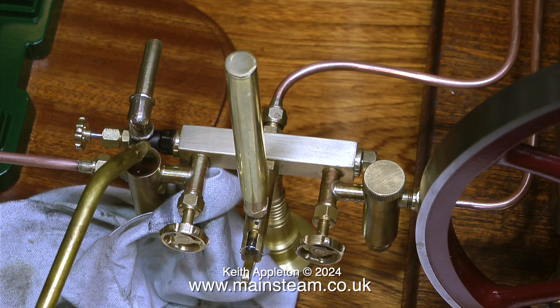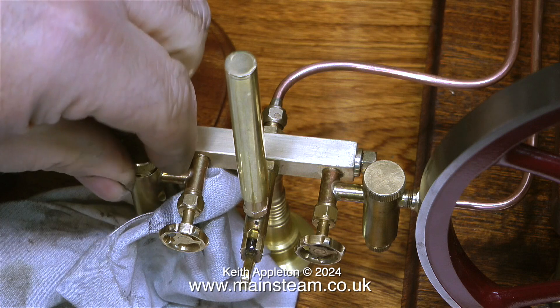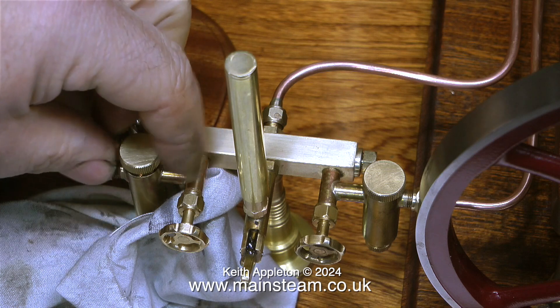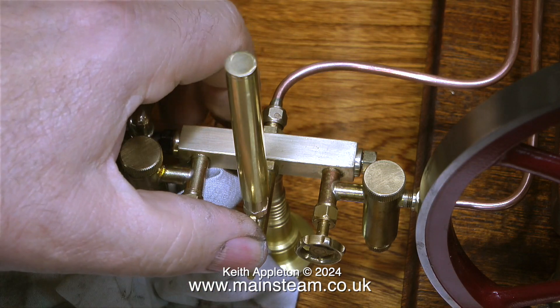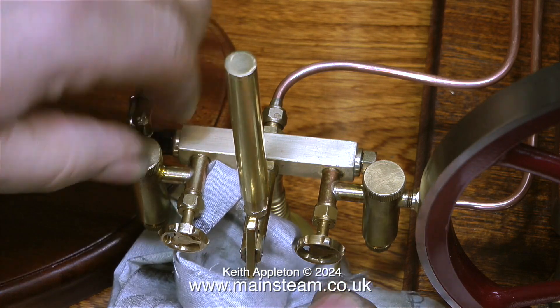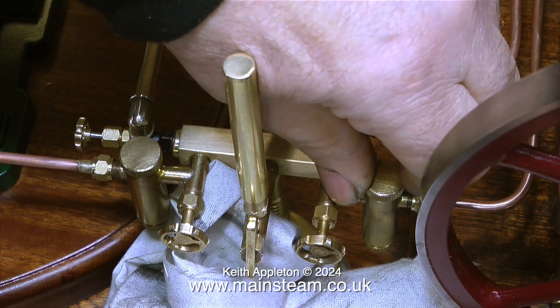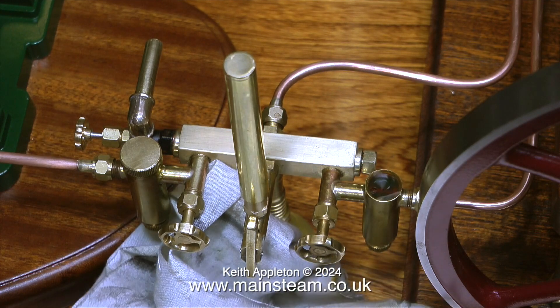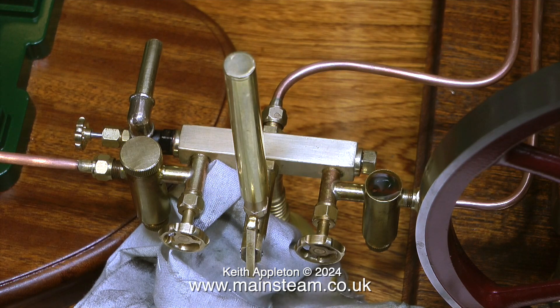There's no pressure yet, so it's a good time to fill the displacement lubricators. Always drain them first by undoing the tap at the bottom to let the water out, then fill them with steam oil and put the cap back on. Displacement lubricators are a really good way of lubricating cylinders on small steam engines. On this plant, the pair of lubricators are screwed into the main steam turret — often these are screwed to the engines themselves, but that can look a bit ugly. They work anywhere in the steam line, apart from attached directly to the boiler. They condense some steam to water, which falls to the bottom of the lubricator tank and displaces oil that's then pushed out into the steam line.